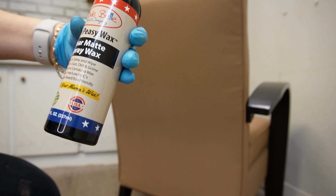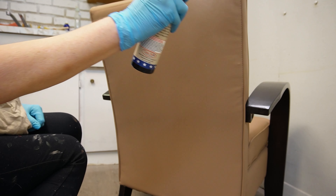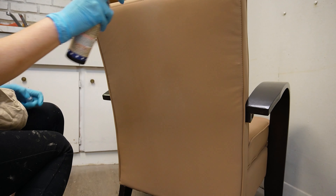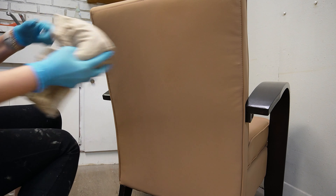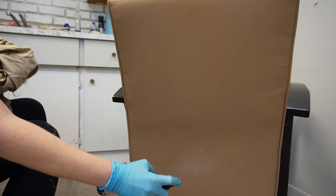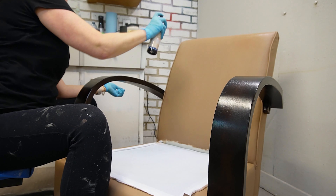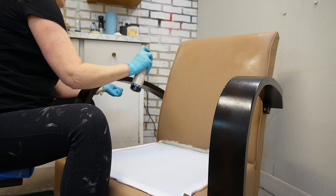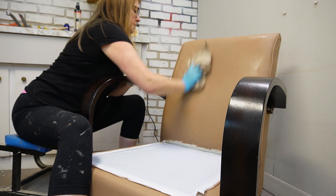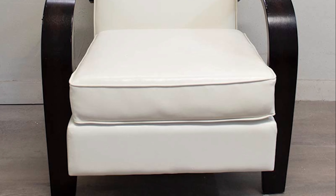To finish off the chair there were a couple of tiny touch-ups. There were a few tiny scratches on the arms, and I used a Trade Secret touch-up marker — they're so easy to use and very inexpensive. They usually come in packs of two or three so you have different stain colors to choose from, and they work exactly like a magic marker. You just draw on the scratches and they blend in nicely. Here's a pro tip: if you're working with a dark stain and you're in a pinch, try using a Sharpie — they work just as well on tiny scratches and blend in really nicely.